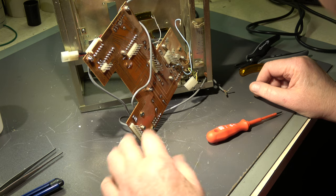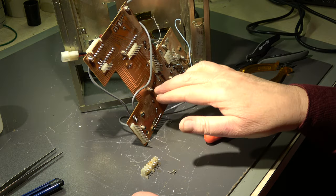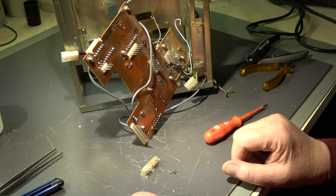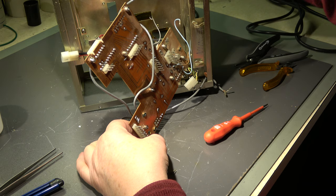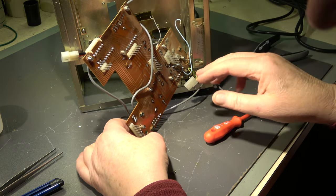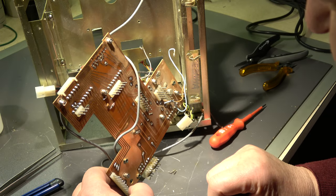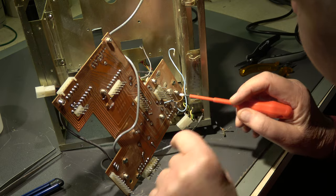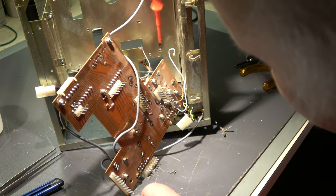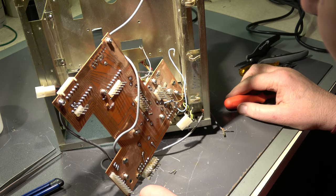I will reinstall and resolder it. Then there's another topic: the ground connections here and here - these ground planes are not connected on the PCB. They need a mechanical and electrical contact to the surface of the chassis to make the ground connection, which is unreliable. You can see there's some corrosion under these screws - this is not a good connection. So I will add some ground connections with green wires, as I've done in the other two restorations.